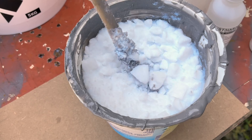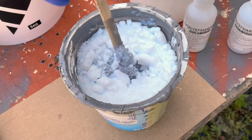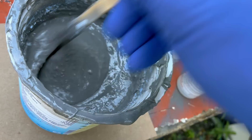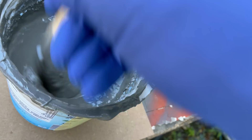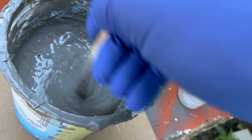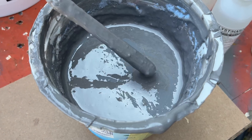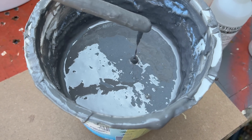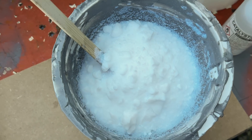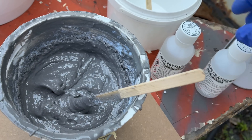The aluminium trihydroxide powder, which reduces shrinkage — and polyester is susceptible to shrinkage — mixes in fine, but the hyper-light silica takes more care and slow stirring. You end up with a paste and add more silica to get the thickness you're after. This thickness would be fine for pouring into a low area or painting a thin coating, but for this iteration I want the resin to grab onto some angled surfaces of the mould, so more silica. If you add too much, you add more resin. The clock hasn't started on curing — no catalyst added yet.